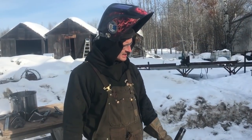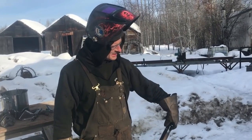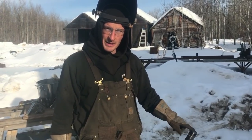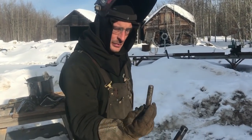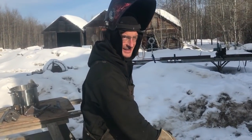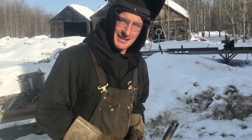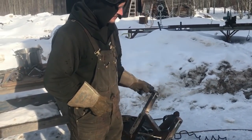Now I've extended these 6 inches, and you're kind of wondering, what is this? What I had to do here is drop some 1-inch HSS inside of some 1.5 by 3/16 HSS, because we didn't have the correct bushing. But, yeah, that's not bad. That works out. Sometimes it might not be what you necessarily want, but it's what you got, and the client will be most happy with this because it'll be working and plowing snow. So, if you don't have a round tube, use a square one.